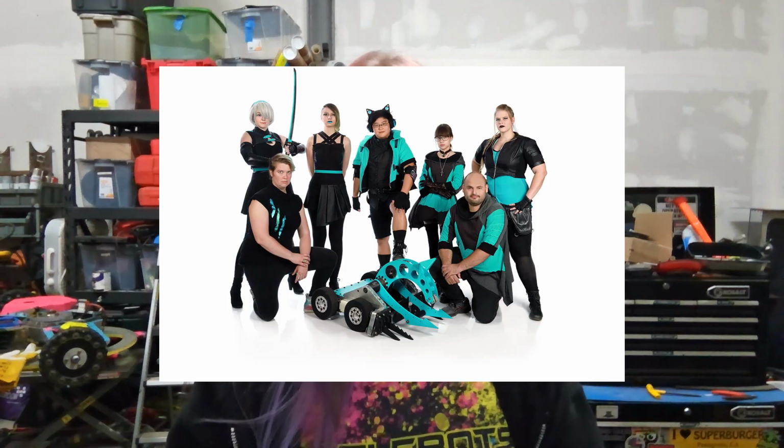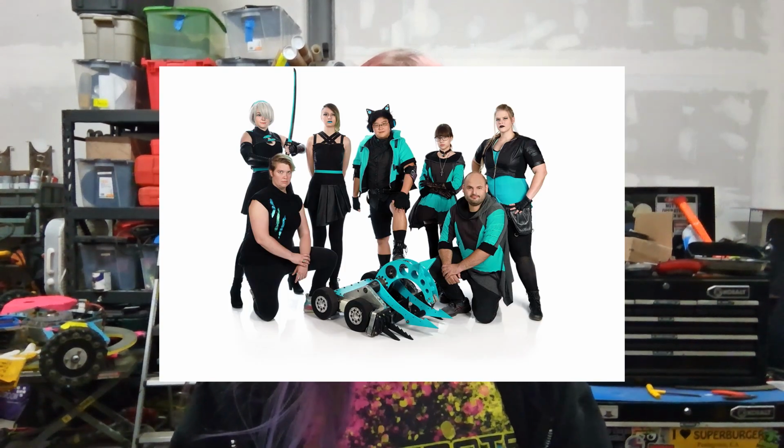And lo and behold, our Miku Blue savior, Charles Overhaul Guan, had in his pit a lock nut with the correct thread pitch and a blue nylon insert. Very on brand. Lock nut, not ideal, we've gone over that. But it fits, and we could torque it down. And hey, just don't reverse the weapon spin direction during the fight, but this could work. Even if the weapon was a little less punchy with this hardware, it's fine, let's just get in the test box. And we got to a place where both of the weapon motors were spinning, we were ready to fight.